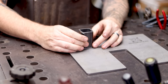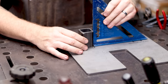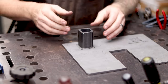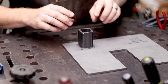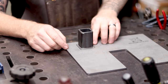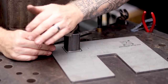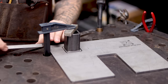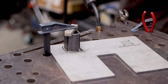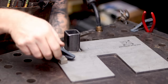The concept here is that you're going to set this down on the inside and check it for level — just take a square and make sure that everything looks fairly level. It's not super important because every Revolution grinder — you could probably bolt this up to just about any two-by-72 at this point, though you would want to modify where this goes. We're going to eyeball it, it doesn't have to be perfect, and then we're going to put one tack — just one strong single tack — in there. That's going to be kind of a strong tack, but just a single tack. Let's clamp this down, put the tack in, then fit it up to the machine. That's where the tuning of this device actually starts.